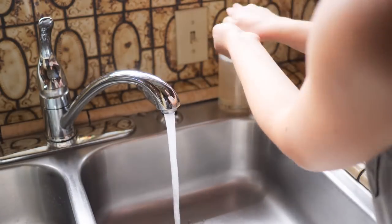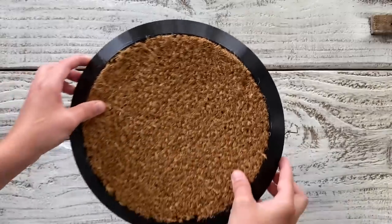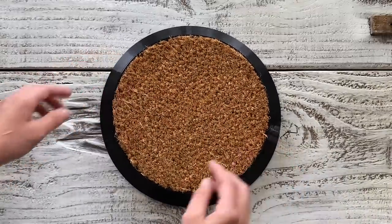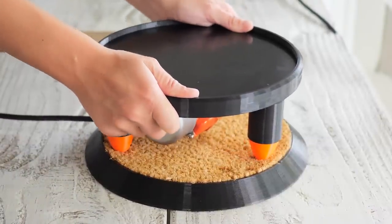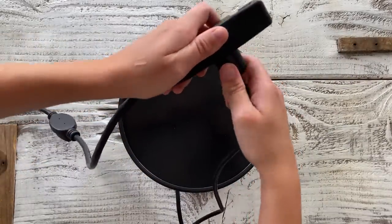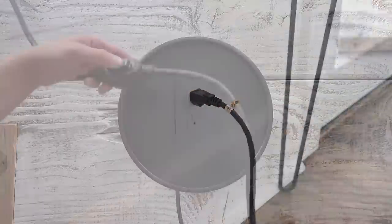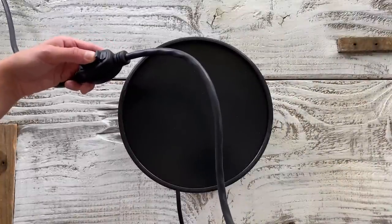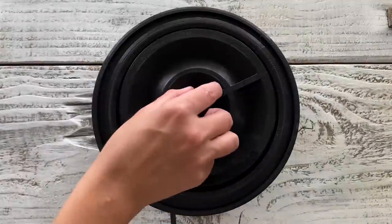Before handling any material intended for consumption, please wash your hands thoroughly. Start by placing the stabilization mat on your work surface. Place the vibration table on top of the stabilization mat. Plug the vibration table cord into the included switched extension cord. Plug the extension cord into a grounded 120-volt power receptacle. Use the switch on the extension cord to turn the machine on and off. Set the cartridge on top of the vibration table and set the included riser aside for now.